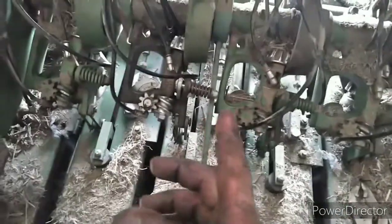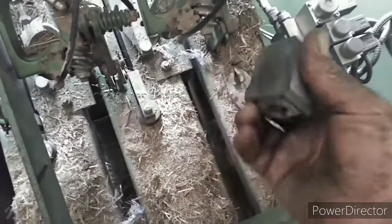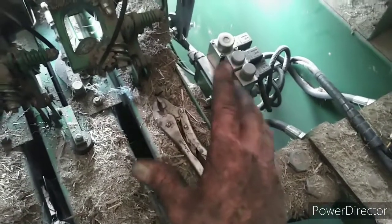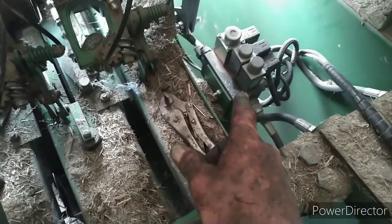I did take a couple of knotters off the old baler. Eric came and helped me — we tested the solenoids. There's one right here. They all checked out for ohms, but we switched it anyway and it's still reading the same code. So I'm not quite sure.